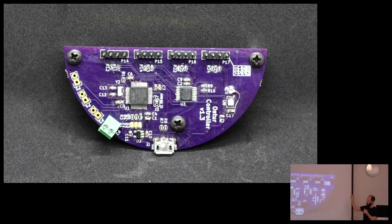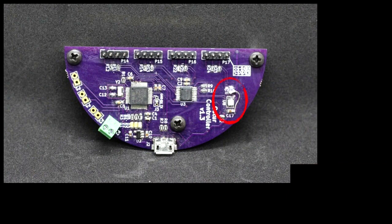But anyway, we have this new version. Some new things here. I have a smaller 3-volt regulator, because I don't need that huge thing. I don't know why I circled this. USB, oh yeah, it's USB only. I got rid of the UART. It was a backup. I basically got the firmware stable enough that I could do everything over USB. So the microcontroller was USB serial. I could do firmware updates over USB.